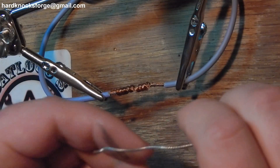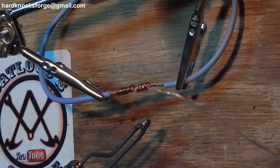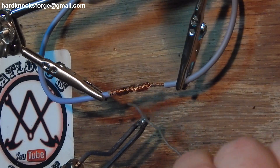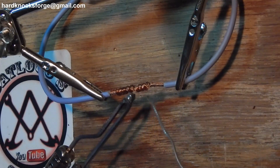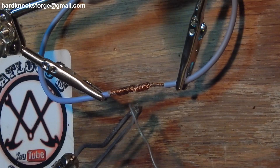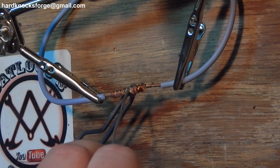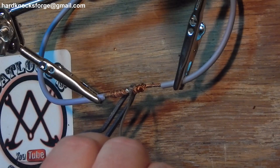Now we're just gonna go ahead and use up some of the stuff that came with the Weller. I'm pretty sure it's rosin core. The thing about soldering is, you don't melt the solder on the tip and then glop it on and let it drip on. You heat the wire up, and then you put the solder right on the wire. What you always want to do first — tin the tip — which means you hold it until she gets hot, put a little solder on it, then put that right underneath the wire.